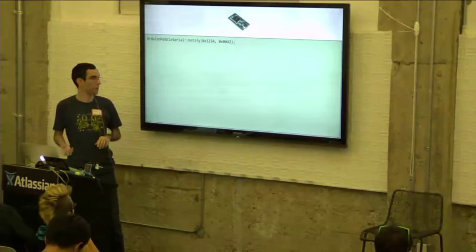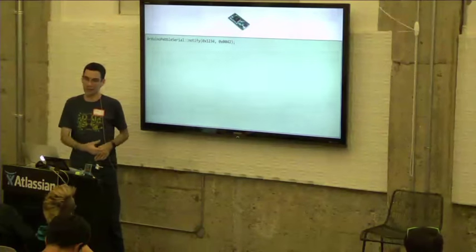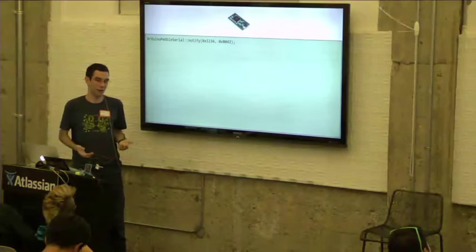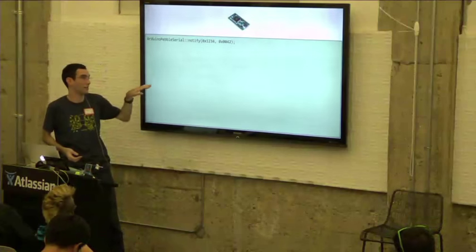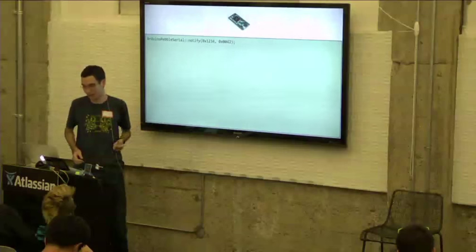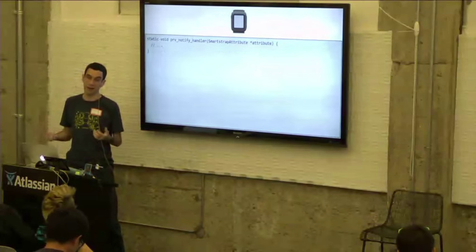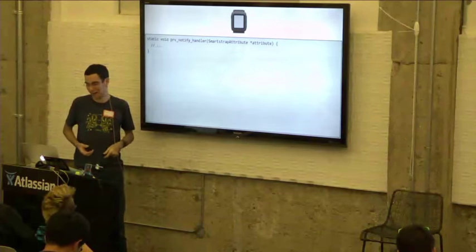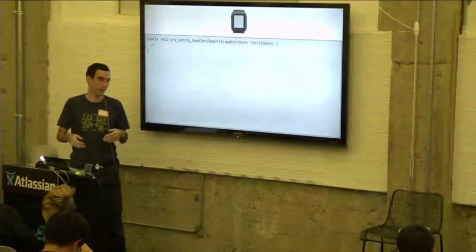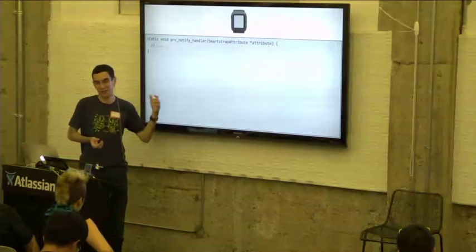On the Smartstrap side, that simply looks like a call to this notify function. We're just going to pass the service ID and attribute ID that we want to actually make that notification for. In this case, it's the same one that I've been using, service 1234, attribute 42. Now on the watch side, another one of those handlers that we subscribe to using Smartstrap subscribe is a notify handler. And this, again, just gets called whenever we get this notification. So all that this gets passed is just the attribute.